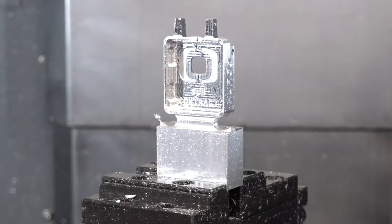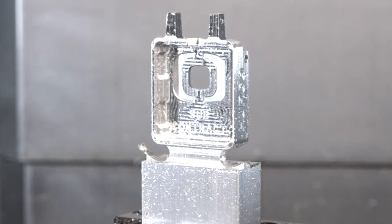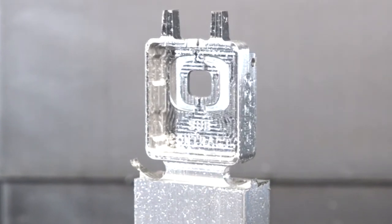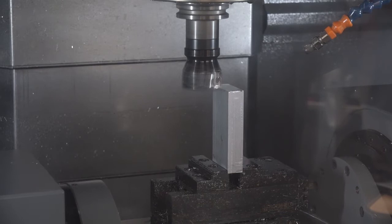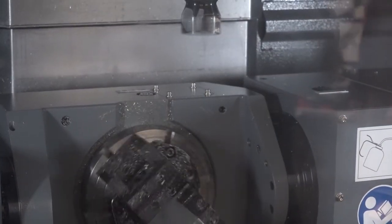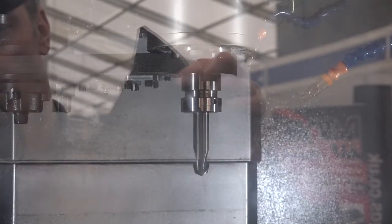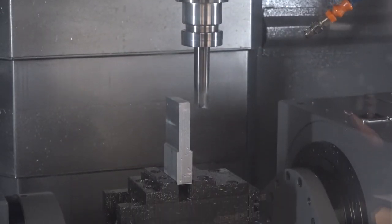You can machine up to around 250mm cube, or anything within that, allowing for the work holding. It's aimed towards smaller components, mainly machining aluminiums and lighter materials, though you can cut stainless steel, Inconel, whatever you want. It's mainly more for the subcontract market. The VM10 is a very small three-axis machine and this is an extension of that with a change of configuration — very similar design, with a 10,000 RPM spindle, a 20-station swing arm tool changer, and around 20 metres per minute rapids.